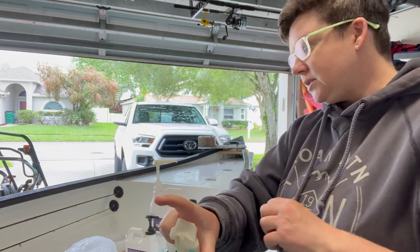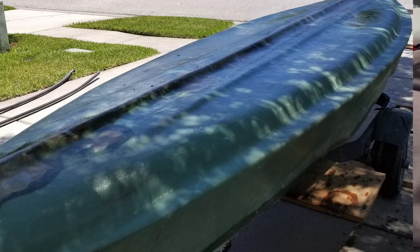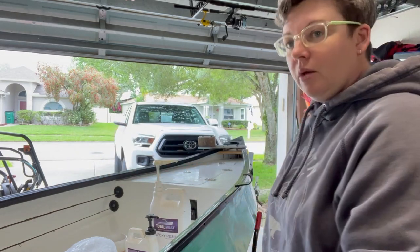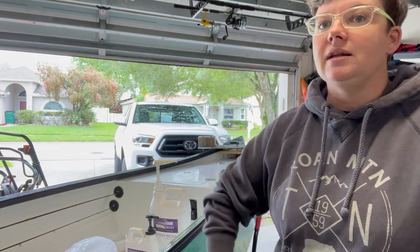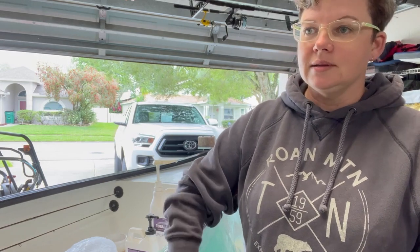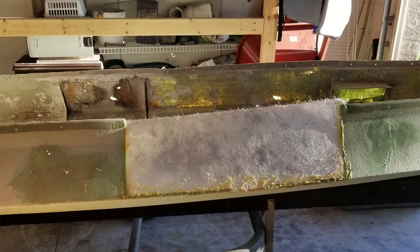For me, that's exactly what I wanted. I ended up laying one 16-foot strip along the bottom of the boat and one on each side, so there was a total of one complete new layer of fiberglass all the way down. The edges, the front, and the transom had multiple overlapping layers to make sure I had as much strength as possible, because once I took down the old paint and old fiberglass it ended up being really thin — to the point where I could easily just wobble it.